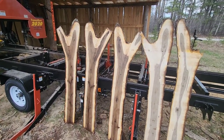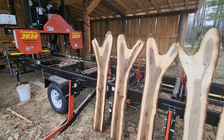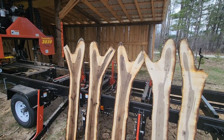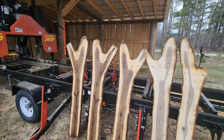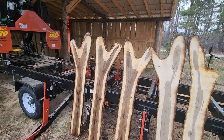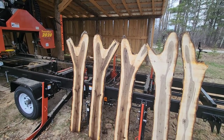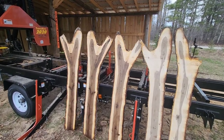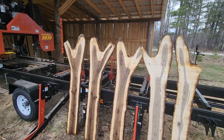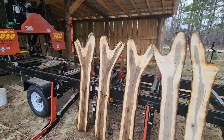That's what I absolutely love about working these small little pieces. Because if you have a sawmill, you don't have to have a great big one — you can have a 1220, a Cook's MP32, a Woodmizer LX55, a LT15, or Norwood, Woodland Mills. The list goes on. You can cut this same log on any one of those mills. But know that the smaller logs have a higher tendency to want to roll on you — they're just harder to pin down. But they can have some really amazing grain in there.